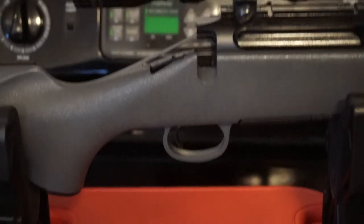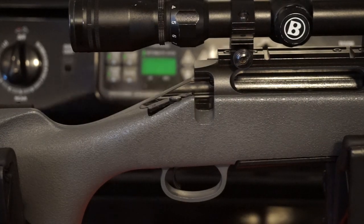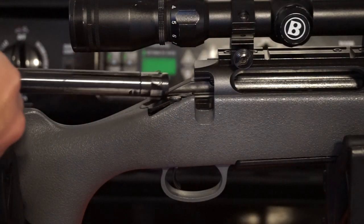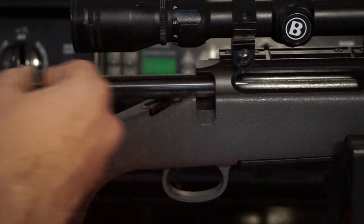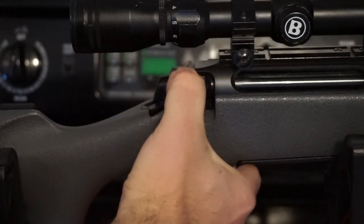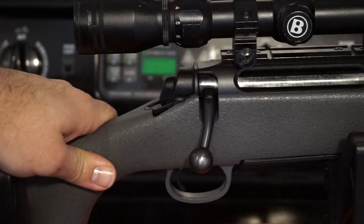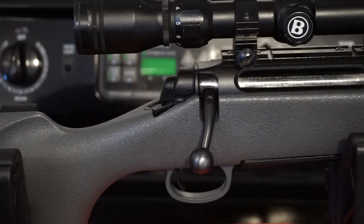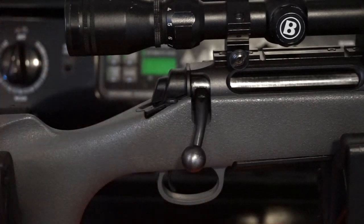When you give these guns a good cleaning, you're going to be amazed at how much smoother the action is. Make sure the little lever on the opposite side of the receiver is up, otherwise the bolt won't go back in. Slide the bolt back in — look how smooth that is. Make sure the gun is empty, then go ahead and cycle the bolt. It takes a little effort to lock it, but it's really not a big deal compared to other rifles. Go ahead and dry fire to ensure you put everything back together correctly — we're good to go.